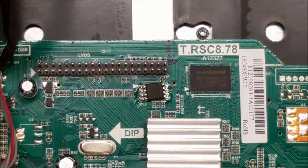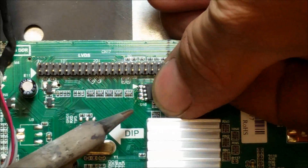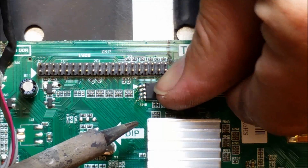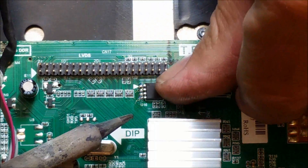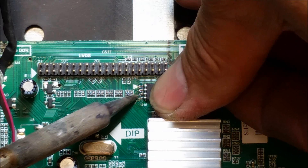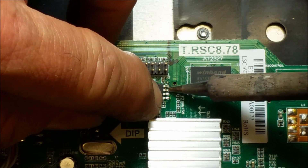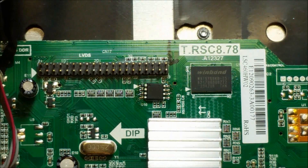I have the data written to the EEPROM. I'll get a little bit of light over here so I can see what I'm doing as I solder this back in. Just make sure you have your pin lined up with pin number one, and I can finesse it back into place. There we go — one side done, and there we go on the other side.